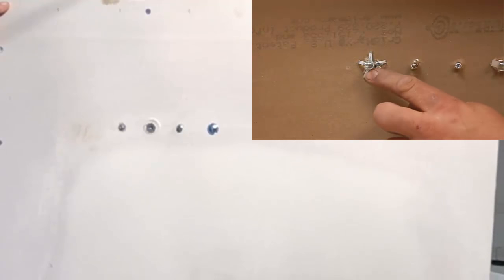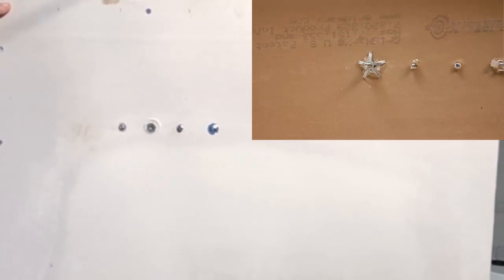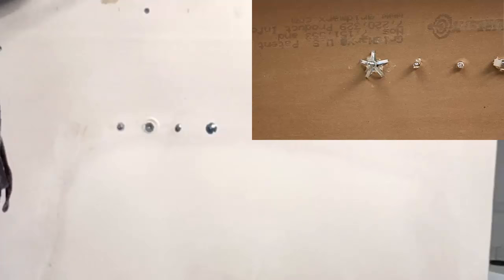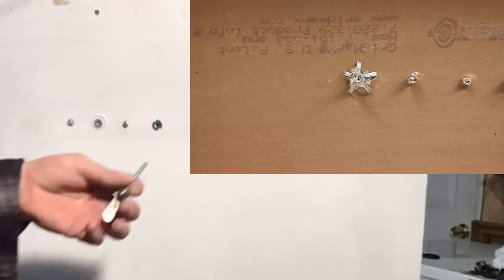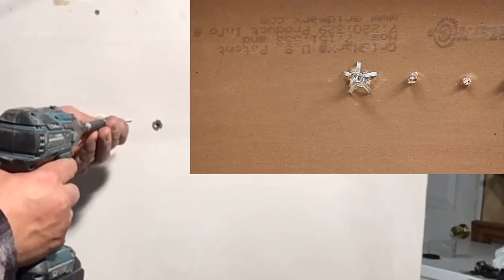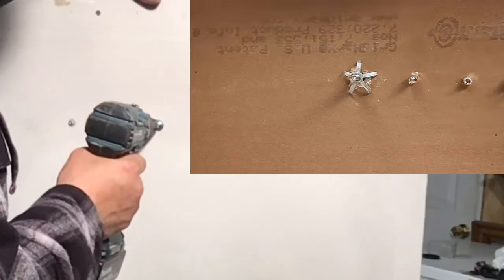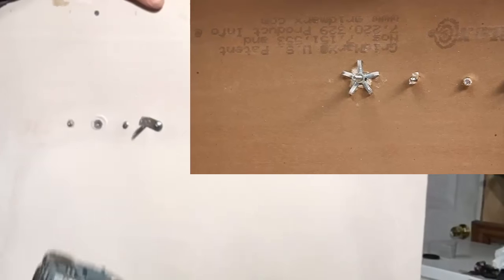You can see how it opened up in the back and held onto the drywall. If you push it too tight, it's going to over-tighten into the drywall. So what we want to do is mount the item first — whether a towel bar or whatever — take the screw out, mount the item, and then tighten it the rest of the way.